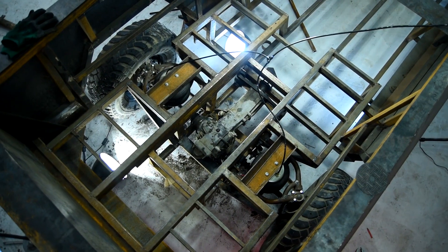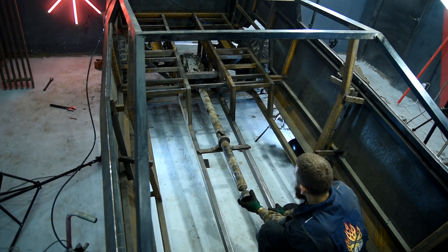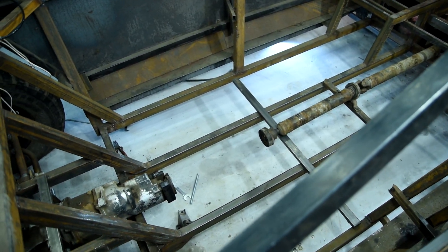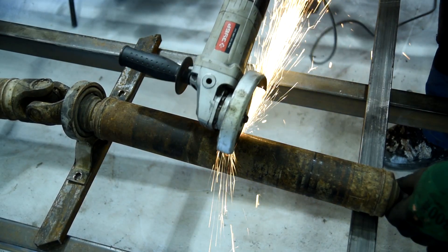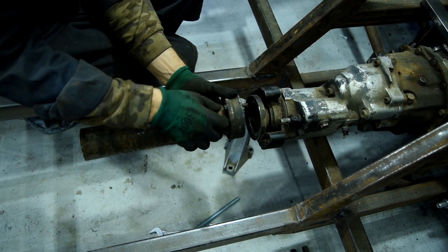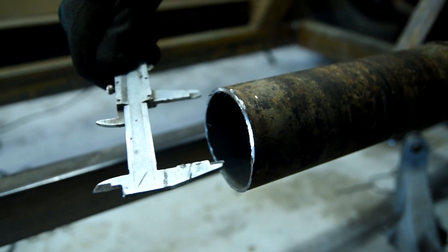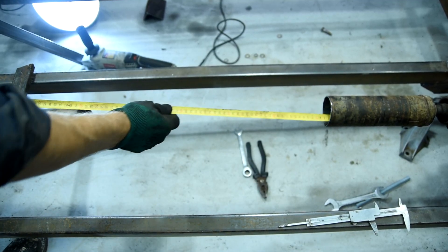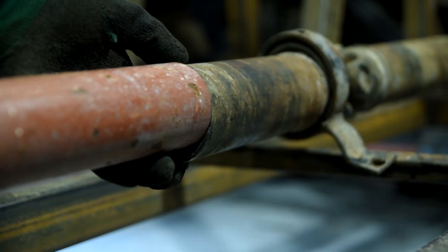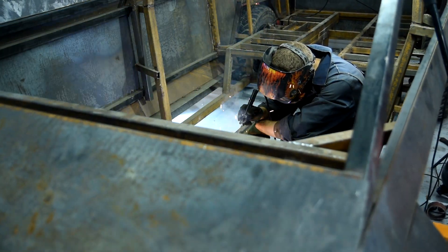The details of the rear and front axles are installed, so they can be connected with a cardan shaft. I screwed the cardan to the reduction gearbox as a fitting — it was obviously short and needed to be lengthened. I'll calculate the optimal length without paying attention to the beat and curvature of the welded parts, as this procedure will be made by specialists who lengthen and balance the cardan shafts. I cut the short cardan pipe in two parts, screwed the hinge to the box, measured the interior to find a suitable tube for insertion, then joined the parts and welded them on a pair of points.